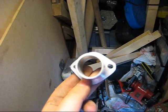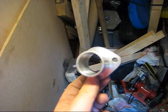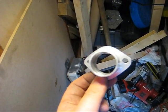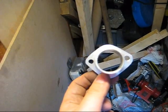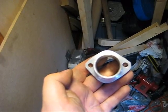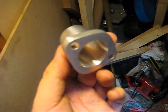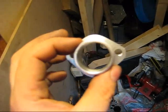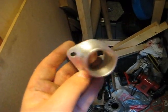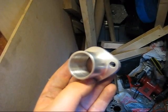Okay, so this is the finished piece. I had to file the holes slightly because I got them slightly wrong — they're filed out to a slightly oval shape because it was difficult to get the bolt holes to match up the carb and to get the manifold and the outlet of the carb concentric. Slightly wonky shape on the flange, but it's not going to matter. It's got a nice smooth bore on it, so the next thing will be assembling the engine, which hopefully I'll get done in the next couple of days and then have it up and running. Check back in a couple of days!